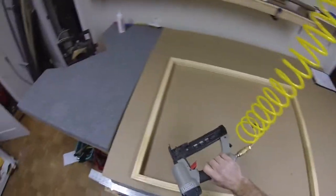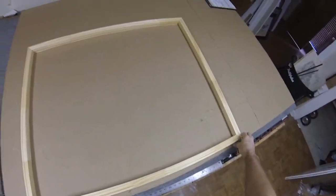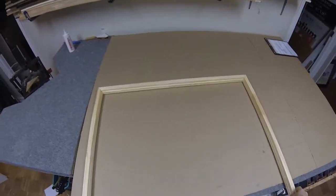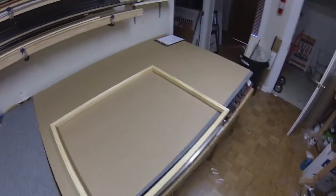In the event that you don't have this joiner equipment, you can Brad nail it with a gun like this — pop, pop, pop, pop — all four corners. Sometimes Brad nails are just as strong as these V wedges. You can see these little V wedges that just go into the material — essentially the same thing. Whether it's a Brad nail or a V wedge, it just holds it until the glue sets. The glue is the most important part of the whole process.